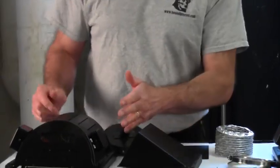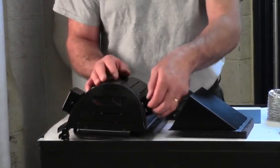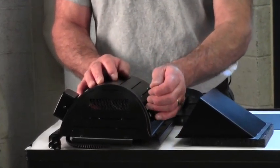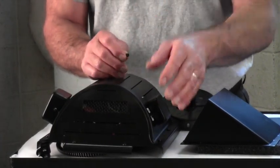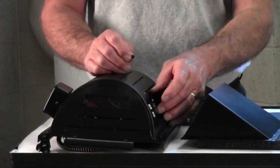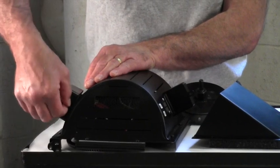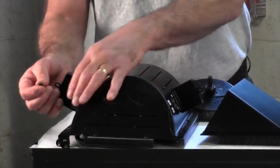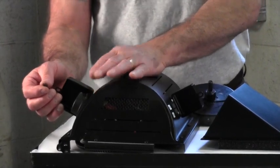A little bit more about the products. We've put in a little set screw or clip depending on which model you have, but they both work the same. This little set screw comes out easily, or the clip on some models will pinch together and come out. Underneath this you have two switches — one for heat and one for breeze. Under this cover you have the thermostat. When you take out this little bolt, you can lift this up and make your adjustment depending on how warm you want the doghouse or when you want that fan to come on.